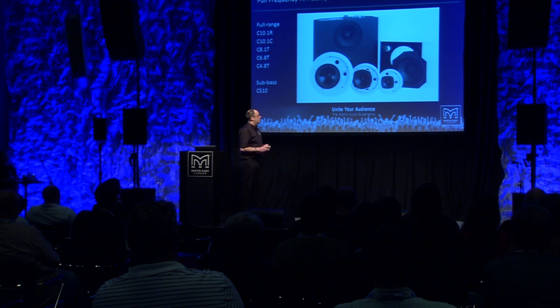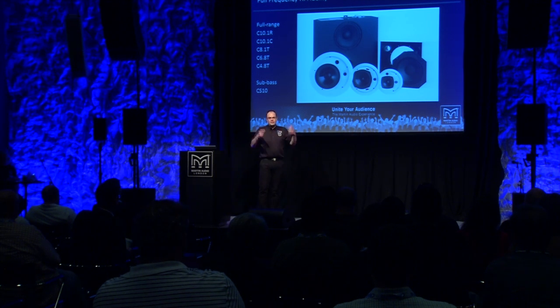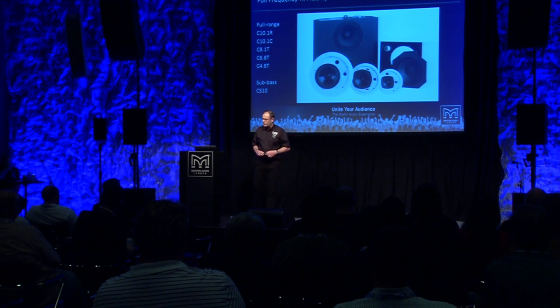The tapping control for these loudspeakers, when used on a high-impedance distribution system — your 70 to 100-volt line — is on the front baffle, so they're easy to change without having to get them back out of the ceiling again. Grills are shipped separately so they can be first fixed, and when you're happy that the sound levels and tappings are right and you've finished the installation, you can pop the grills on right at the very end.